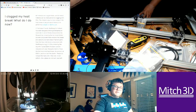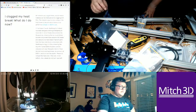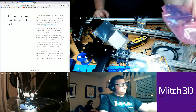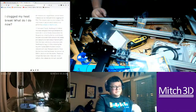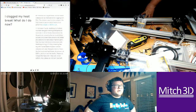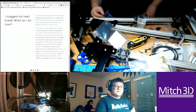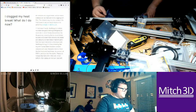No, I have not, mainly because of time. I kind of want to get the stock H2 running, because I still have to work on the backpack components, and that's more important to get this thing running. But since I have the Mosquito hot end, I'm getting the Duet effector mount, and I have a Duet, and I printed the Duet adapter board. I think I'm just going to switch all my components right now and then work on it kind of custom. The problem is I have to do some calibration to get it working with all the new components, because they're not the same as the stock H2. So the fewer issues I have, the better. I might end up having to switch it back to the stock hot end and the Rambo board, but I think the Duet stuff should work pretty well.